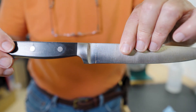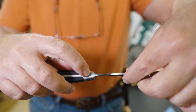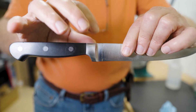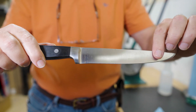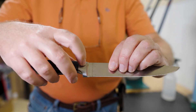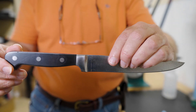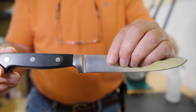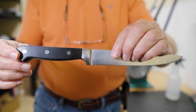This knife was originally probably sold as a fully forged knife, which means this bolster here is all one piece, made on a forge that comes down with great pressure while it's at critical temperature — red hot — and shapes it into this shape. Very good for a blade to be forged. But what they did here was a forged bolster so it looks like it's forged. They'll tell you it's fully forged, but this line right here shows us that they added the blade afterwards. This is not a fully forged blade — that's why they can sell these so inexpensively. So if you see on a $300 block set that it is fully forged, it's probably a lie. After a while you'll see that line begin to form and you'll realize the blade is not forged.